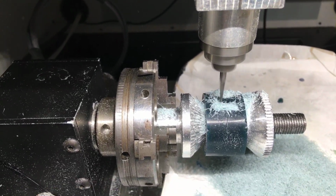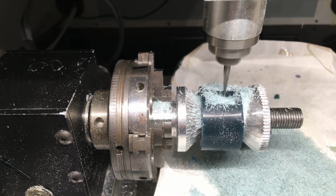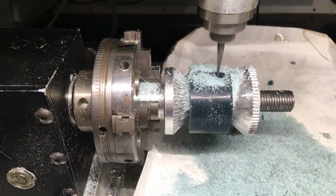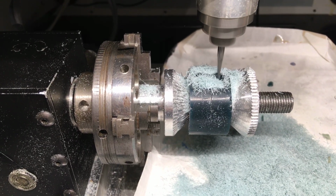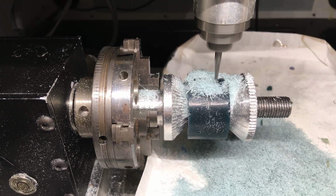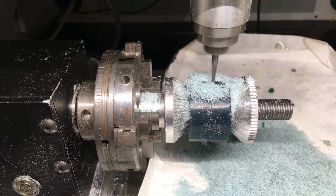It's cutting in probably about 7-8 millimeters deep. It's one cut pass, so I do it all in one cut. Probably at least 7. I forgot to measure the outside of the tube. The ring is like 3 millimeters thick, so it's about 6 or 7 millimeters it's cutting.